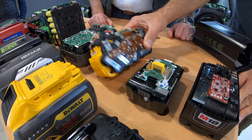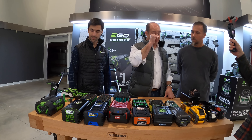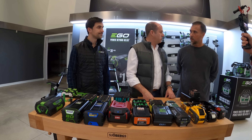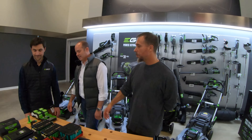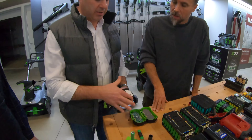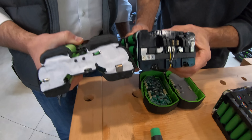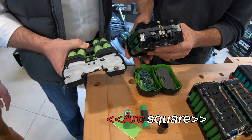There's a lot of great science that some manufacturers build into their systems to control heat so batteries can work under extreme conditions. There's different science we all deploy, such as three parallel rows of cells, which we've used in the Ego battery pack — something we've been doing for several years that we're now starting to see in the power tool industry, which is very effective, especially for high amp discharge conditions. But bricks are bricks, so what we try to do is something a little bit different. You're the only one that doesn't have a brick? Yeah, we have a patented arc design. The arc design allows every cell inside the battery pack to have exterior exposure so you have more surface area and it's easier to cool.